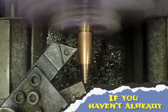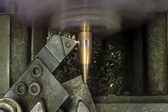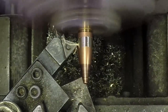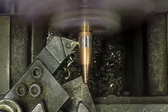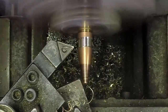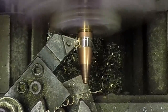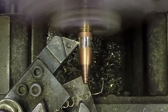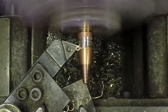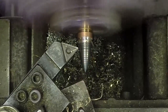Let's fire up the lathe — about 4,000 RPM to cut. What we're trying to do is thin through here without crashing the lathe. Each pass is probably four thousandths, maybe five. The point of this copper, by the way, is to give the rifling something to bite into. You couldn't shoot a solid steel core out of here because it would eat the barrel out of the gun. The copper is nice and soft, and the rifling gives it something to bite into and get the bullet spinning when it comes out of the barrel. There we go — off she comes.